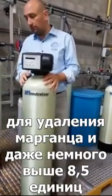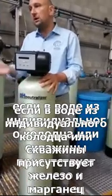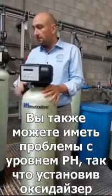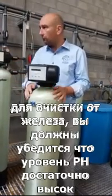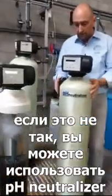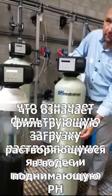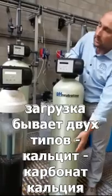For manganese, a pH of 8 to 8.5 is preferred. Typically, iron and manganese are found in well water — if you have a private well you may have iron or manganese in the water, and very often you will also have a problem with low pH. So if you install an oxidizer for iron removal, you have to make sure the pH is high enough. If it's not high enough, you can use a pH neutralizer.